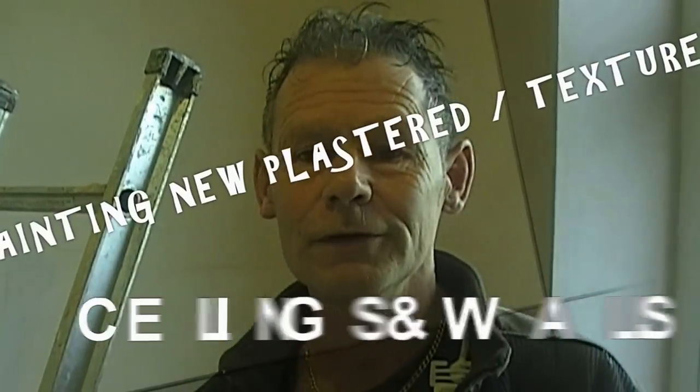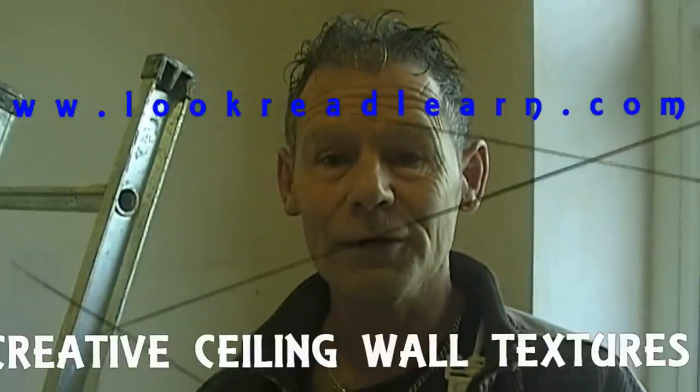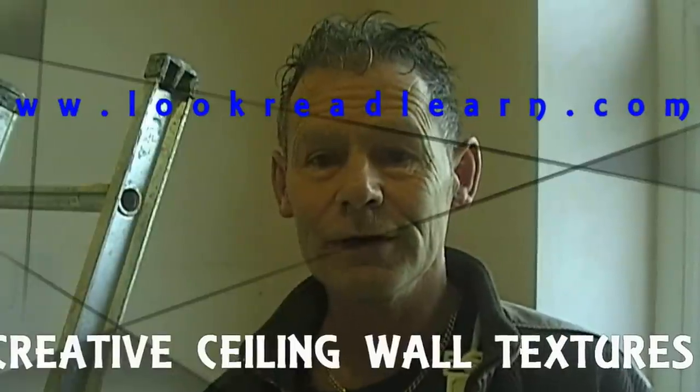In this video, I want to talk about painting a freshly plastered or textured surface, you know, a wall or ceiling. The first thing you need to do is, once your area has been plastered or textured, you must let the whole job dry off. There must not be any dark patches on the plaster or the texture. The plaster or the texture has to fully dry before you commence any type of painting.